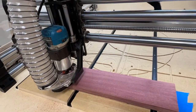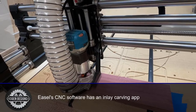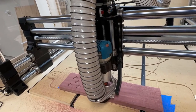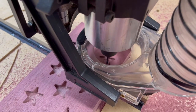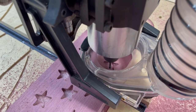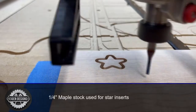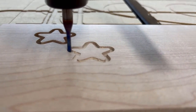While I wait for the glue to dry, I turn my attention to the CNC work — specifically the inlay that's going to go inside the purple heart. The first step is to create the pockets in the purple heart, and then cut out the maple inserts that are going to go inside those pockets. If you don't have a CNC, there is a product on Amazon with male and female router stencils where you can just do this with a regular router. I'll leave the link in the description below.